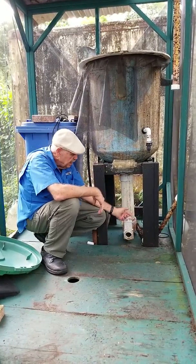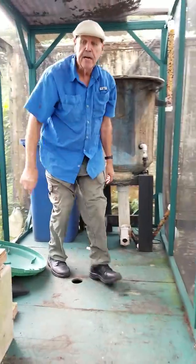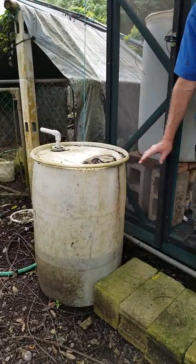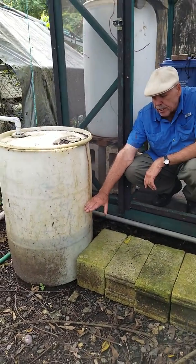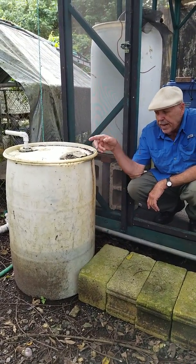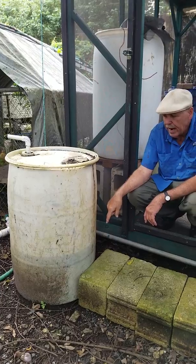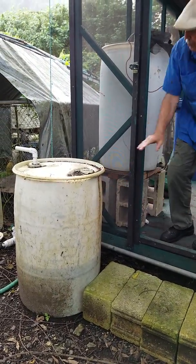When it's all done, I hook up a pipe, open it, and take it outside to this drum. This drum lays on its side and I run the liquid right in through a fitting — it fills up to about 25 or 30 gallons, so it's only half full. Then I stand it up — no problem. I screw a cap in here with a garden hose attached, and that pipe goes all the way to the bottom. I put pressurized air in this side and it pumps the contents up.